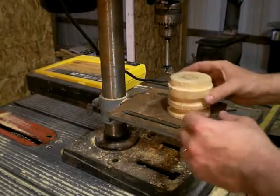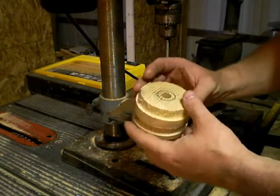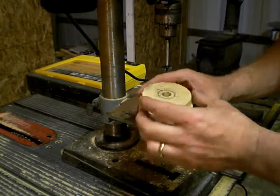After a bit of cleanup, we've got the two v-belt grooves. Now I have to drill the hole out to be seven eighths of an inch, because that's the size of the shaft it's going on. I have both of those drawn.